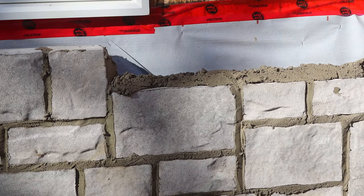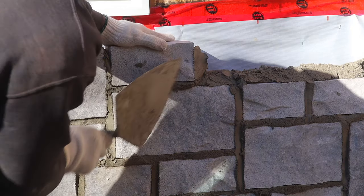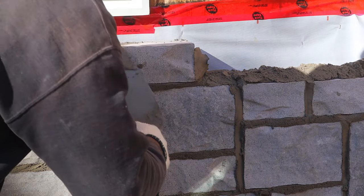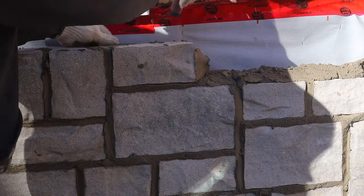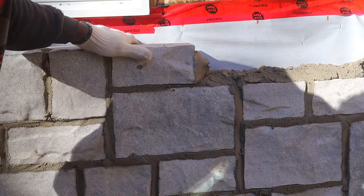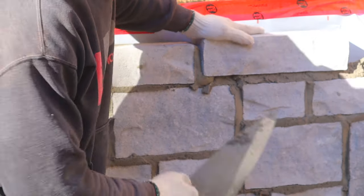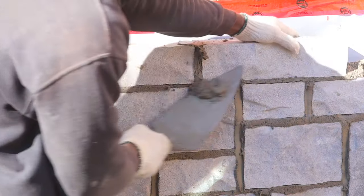Put a one brick tie over here. One right here. We'll put another one over here again. This is my last row now. Right here is where we finish with this wall. Just leveling them, go right across.